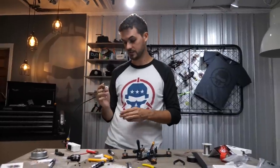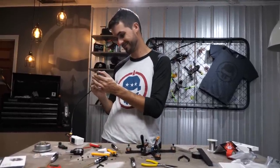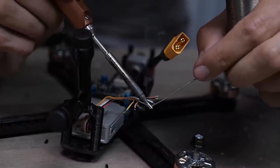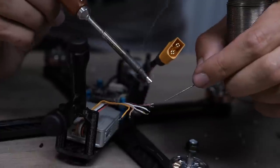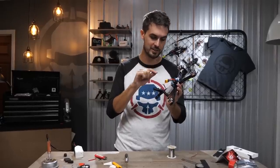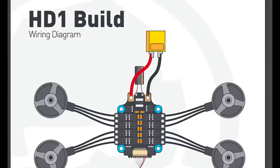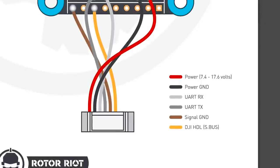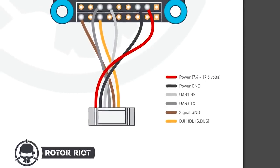We're working on much smaller wires than before, so drop the temperature to about 380°C. Add solder to the stripped wires. This is the most technical part of the build because you have to get all these different wires on the correct pad. We have a wiring guide available — link in the description — that walks you through this entire build with pictures and wiring diagrams.